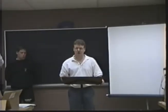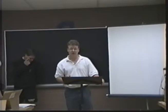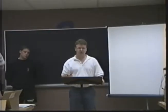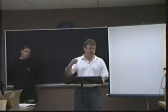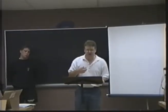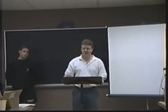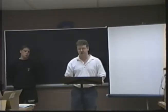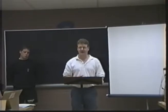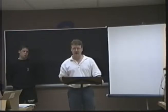Thank you, Rob. Probably now, at this point, after Rob spoke about the emitter, the most important part of the detector circuit itself is the use of a tone decoder, because the Archer receiver will pick up the 40 kilohertz carrier and only transfer a 200 hertz DC pulse from the receiver. Now, a 200 hertz DC pulse is not very useful, as it is useful, but it is not the ideal input we'd like to have into the microcontroller in order to determine which of the receivers is picking up the directionality of the robot.